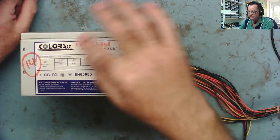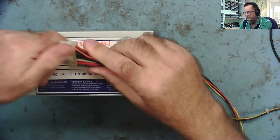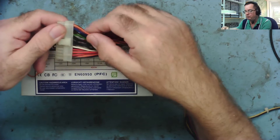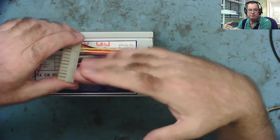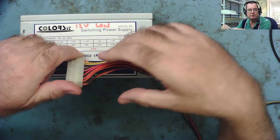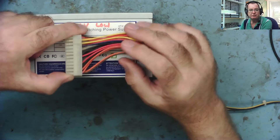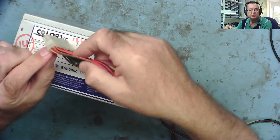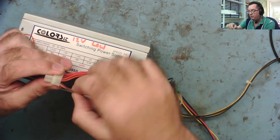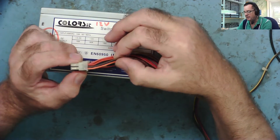This one - I made a note that the 12 volt is low. Looking at the power supply, it's got a 24-way ATX on this one. One thing I've actually learnt while working through these power supplies is an easy way to tell which voltage rail it's checking to regulate. It monitors one of the voltage rails normally, and you can spot it by looking for two wires going into one of the connections - either on the orange, the red, or the yellow. On this one you can see there's a brown wire going in with the orange, and this wire is the sense wire.